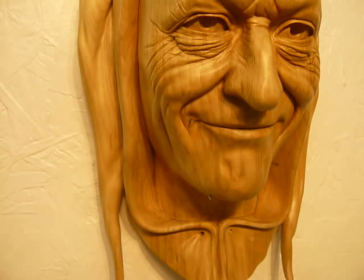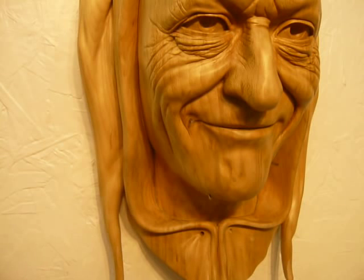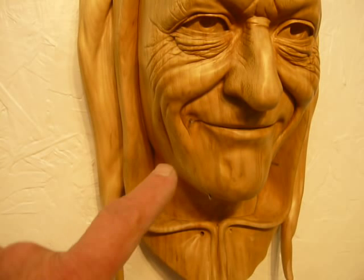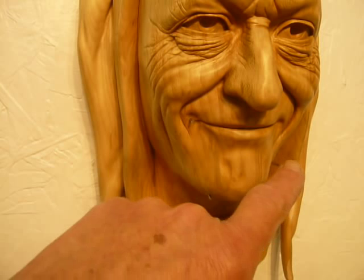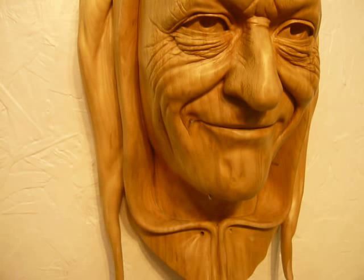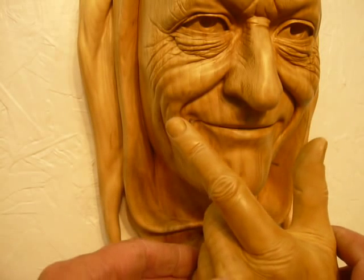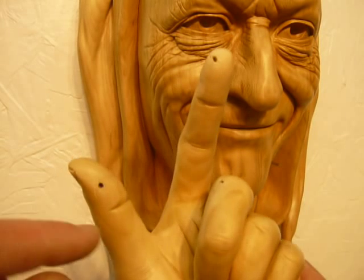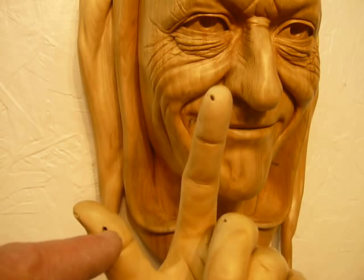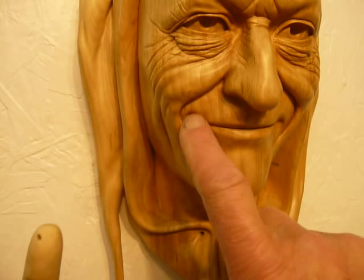The hand is attached to the face at three points — here, here, and here — by putting three steel pins into these points, cutting them off very sharp and very short, and then pressing the hand against the steel pins to mark the fingers. These marks are then drilled out.